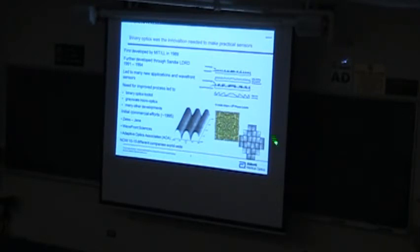And this is just a coarse demonstration. We thought this was a neat picture, and we chose this as our company logo when we eventually formed the company. But you can also divvy it up into a whole bunch of little squares and then multiplex it. So you can see there's patterns here which divvy us up into quadrants and compare the individual quadrants. This is a phase comparator, which is for comparing the phase of different segments of a 64 segmented mirror. So anyway, there are things that you can do with micro-optics which you couldn't do with any kind of conventional fabrication.